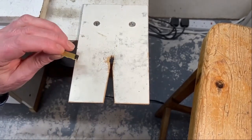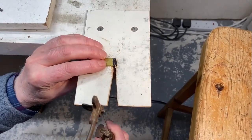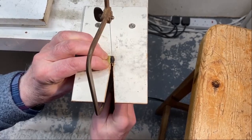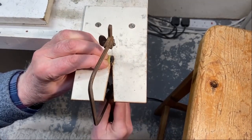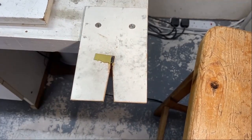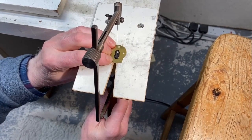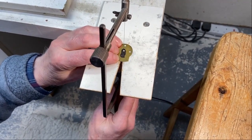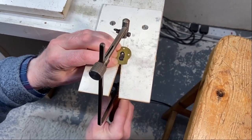Here's an example of using the piercing saw — we have a piece of hardboard with a V cut, usually with a hole in the end. To cut off a small piece, mark it out and then take nice long even strokes, keeping up towards the line. Given time you can remove the piece and then clean up with a file. Sometimes you need to remove a piece out of the middle, in which case drill a couple of holes, pass the blade through the holes, set it up again in the saw, and then work from the inside until you cut out the piece you want.